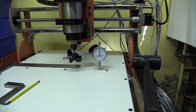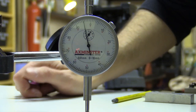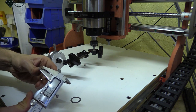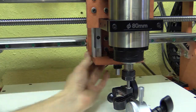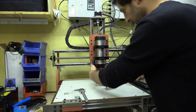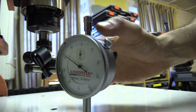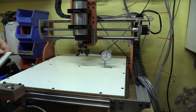When I was happy with the final position I fully tightened the uppermost two machine screws. I can now do the same along the Y axis. There is a nod in the spindle assembly which is quite normal because of the leverage effect the overhanging weight has. To compensate I used thin 0.3mm shim washers to pack out the bottom of the spindle assembly against the carriage plate — there's just enough play in the plate to pull forward by hand and squeeze the shims in. That's less than 0.1mm off over that distance. Setting the Y axis has thrown the X axis off to just under 0.2mm, but these are really small amounts — when you scale those down to the average tool I'll be using between 4–8mm, that angle will be imperceptible to the human eye, so don't drive yourself mad trying to get it any lower.